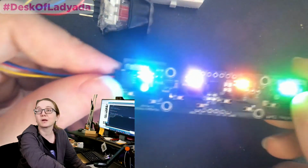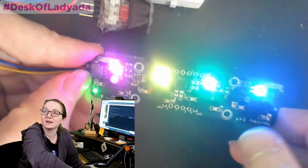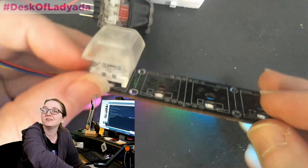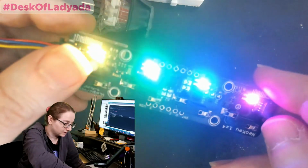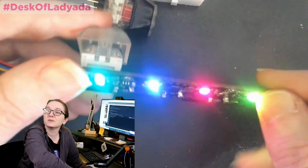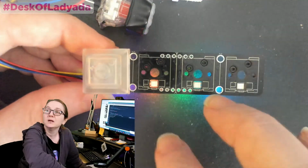Something went wrong with my compiler, and I updated to ARM GCC 11 or something. The last time I compiled this code was, I think, GCC 9. Something changed, probably I have a bug, and it got papered over with an earlier GCC, maybe some uninitialized memory or something. So I have to figure out why it's not working with a modern compiler, but I think I will be able to do that. And then you'll be able to chain these together, read inputs, and blink the NeoPixels to underlight the keys.